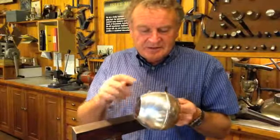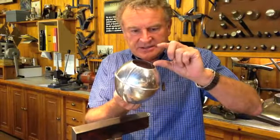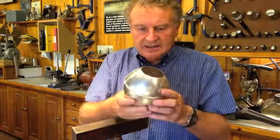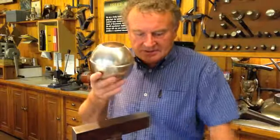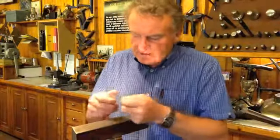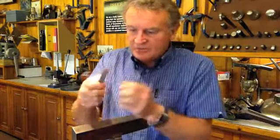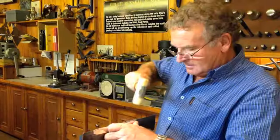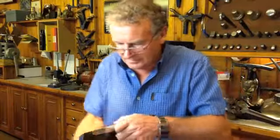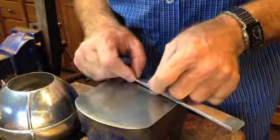Now the two sections are put together — you can see the four panels here. I'm going to now make the little neck; that's the section that sticks out here. But before I do that, I'm going to make the handle to actually carry the milk can. And then there's also the lid, the little cover that goes on. So what I've done is I've pre-cut here some tapered silver, and I'm going to run this down on the hatchet stake here, folding the edge right over like this, and then run a wire through — and this will then give it the strength. The wire is just going to go through here like this and then that'll be tucked up right over.